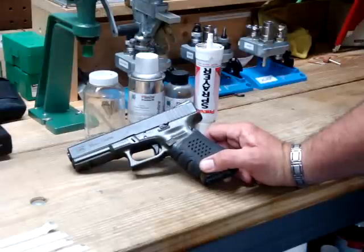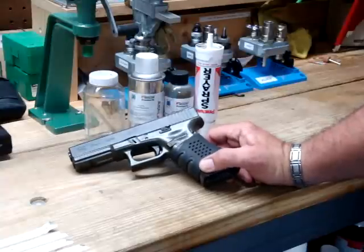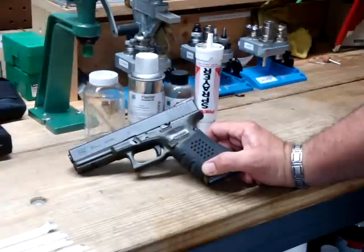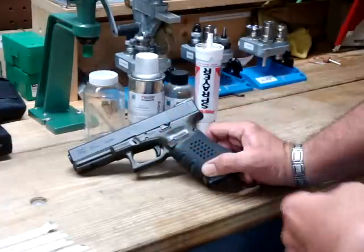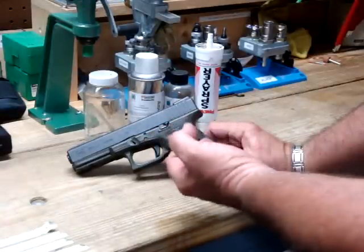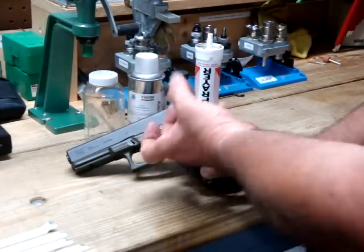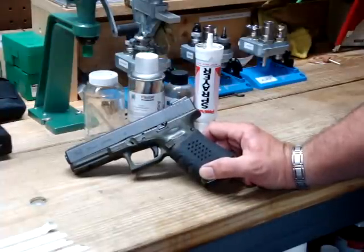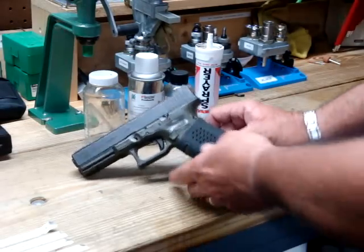I would have preferred the tactical finish, but this cleans up real well — nothing sticks to it because of that slight sheen. It's not horrible. The application finish was incredible. I just put a little weed whacker line through the biggest pinhole in the bottom and hung it so it didn't touch anything. Weed whacker line kind of sticks out like a coat hanger — it's flexible — and I hung it from the lip of the garage door when it was open and just sprayed it. It came out absolutely fantastic.